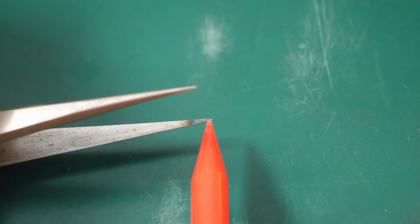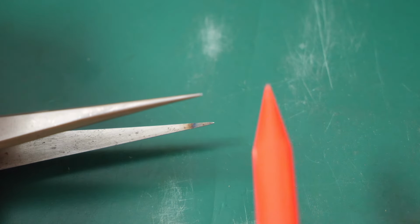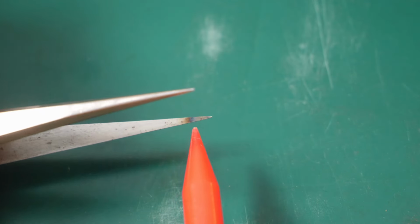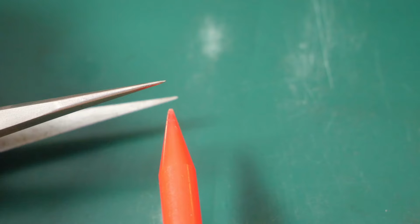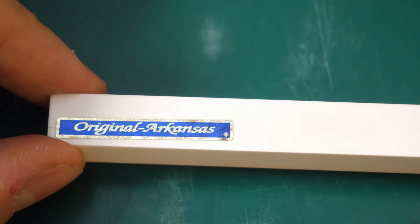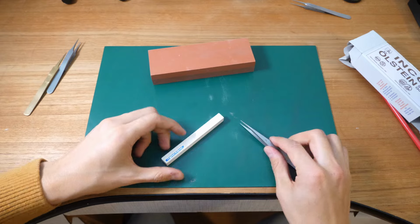Now, as we've seen before, we have the gripping surface temperature color left, and that'll be a good way to see if my grinding technique is going to be fine. So we will have to get all that color off. And the other side is looking pretty decent though. The focus is, there we go. I mean, there's no big real damage here. So I'll use the Arkansas stone. If there would be some big scratches, I would probably start with a more coarser grit. I think this is fine.